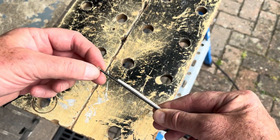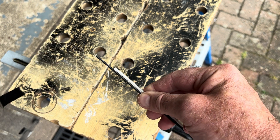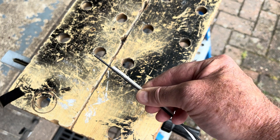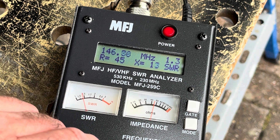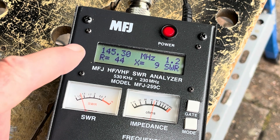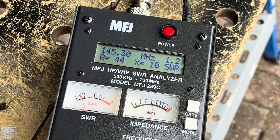The fishing pole has an eye on the end, and I've used a magnet to find where the metal ends inside — it's about there. So I'm touching the top of the antenna about here, with minimal interaction between the metal and the antenna. This is a bit thin to tape to, so I'll eventually tie something on that clips onto it and holds it at a suitable distance. Worth remembering there's a little bit of metal inside that you need to be careful of. This is now exactly 460mm on both sides — there's a dip right in the FM section, 1.2 SWR right across the UK portion of the band. Really happy with that. Just need to weatherproof it now — a little bit of shrink wrap.